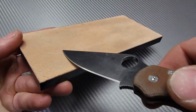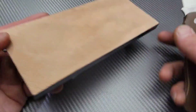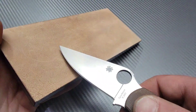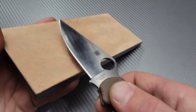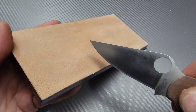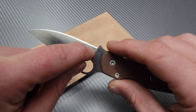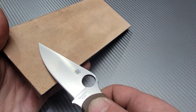The angle you want to be as close as possible to the angle of the edge — the closer the better. But if you can't figure out if you're getting the right angle, just don't hold it upright; lay it down. You're not going to hurt anything by going too low, but going too high will dull the edge. The worst thing that'll happen by going too low is you'll polish the back of the bevel.